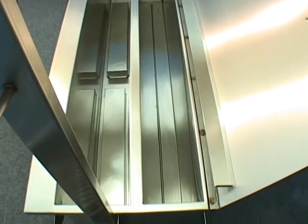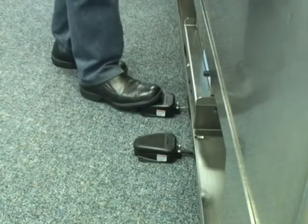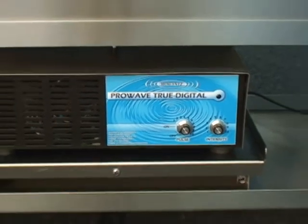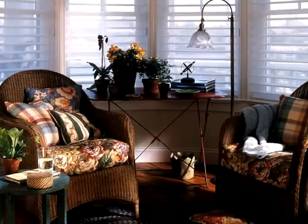Here's how it works. The tank has two chambers: a wash and a rinse. Each is filled approximately halfway with water. At the bottom of the wash chamber are the immersible transducer packs. By clicking once on the EasyStep foot pedal, these immersible packs are powered by the digital generator that sits on the drawer on the stand below the tank. This activates the ultrasonic cleaning process known as cavitation. Sound waves cause millions of tiny bubbles to form and collapse and gently lift dirt away from every crevice of the blind.